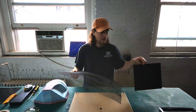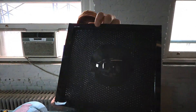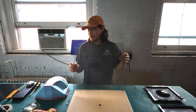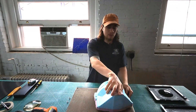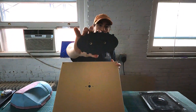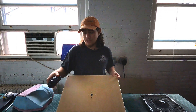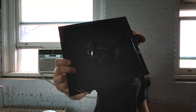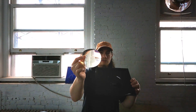The wire mesh base does leave a texture on the bottom of our vacuum form. The challenge with it is that it's difficult to repeatedly place your mold in the same place. If we use a solid base, we can then mount our mold with screws or bolts to any of the holes inside of the space so that we can get it repeatedly in exactly the same location. Here you can see that with the help of all of these tools and materials, you can get some pretty desirable final results — here we have a mold of our found object, which is this lens.